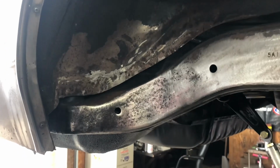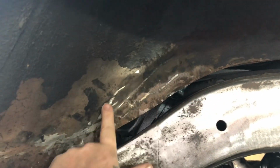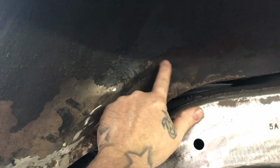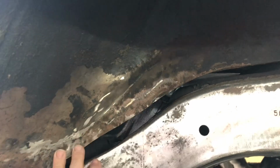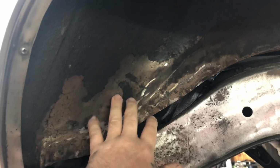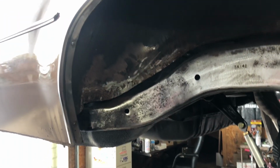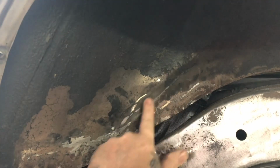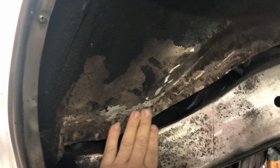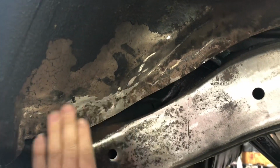But anyway, so this car, you can see how these lines are. These are creases. And I don't know why this car is like this. Every car is different. You see a lot of different things, but this side was creased on both sides. So I'm wondering if this car wasn't rear-ended or something before and fixed a long time ago, obviously fixed by somebody professional, or maybe in the factory something happened. Who knows? But it had these creases in there before I started tapping on it. So again, tap, tap, tap with a nice size hammer. And you just keep rolling it back, rolling it back. It's pretty smooth. So I'm gonna get this side notched.